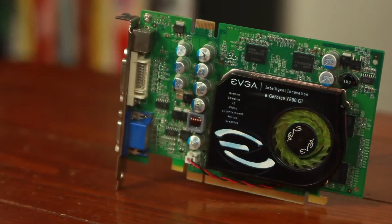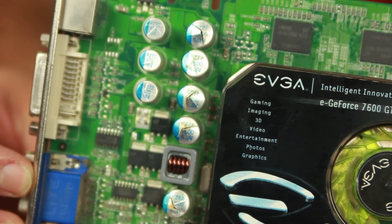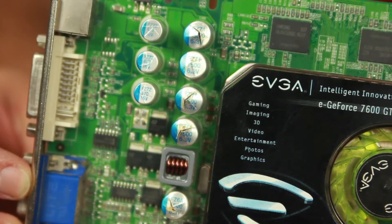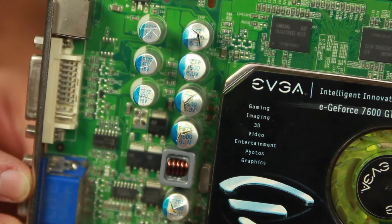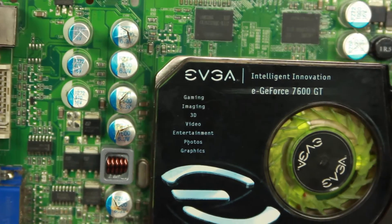You'll see that in the video as things go forward. The process is relatively straightforward. If you have a dead card like this and you can diagnose that these caps are blown, you take a look and you see that they're not flat anymore — they've actually exploded. They look like they have vented. It's like a chest burster of capacitors. And there's really nothing to lose at this point because these things are relatively cheap.